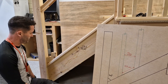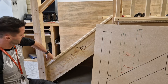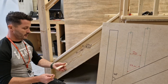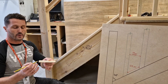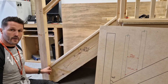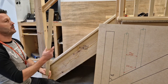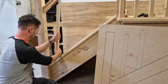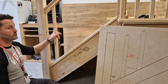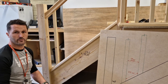So what we do then — because we need seven spacers, one for the top and one for the bottom — we'll cut one angle at 40 degrees and we'll cut one angle square. Then when you put your first piece in, you put the square edge tight so it's got a gap for the dust, and then you lay your spindles out. Then you put your first spindle in, make sure that's plumb, and then from there on out, every spacer should be 114 millimetres.